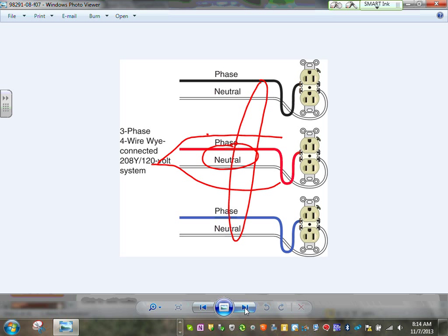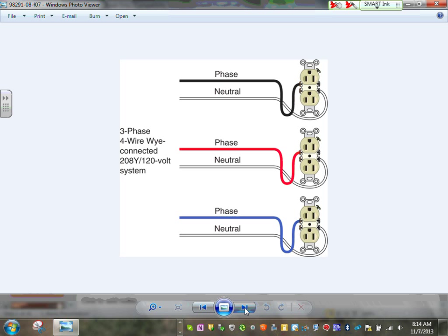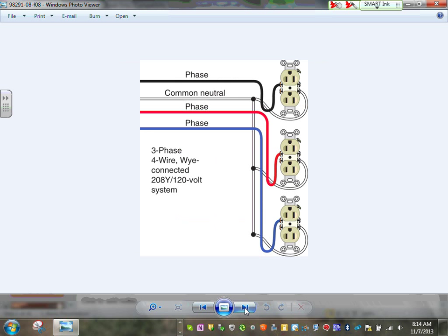Pulling the neutral, like I said, here's what we do, guys, most of the engineering. If you know that the load is going to be electronic, we can go directly and pull a neutral on every circuit. Everybody understand why we pull a neutral with every circuit, guys? If you have a harmonic problem, your answer would be one neutral with a branch circuit. What's wrong with that? If you're an electrical contractor, that's a lot of money. That's extra two wires, guys, for every three-phase branch circuit. So it's a big deal.